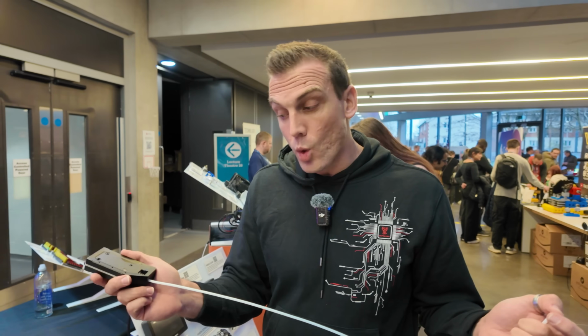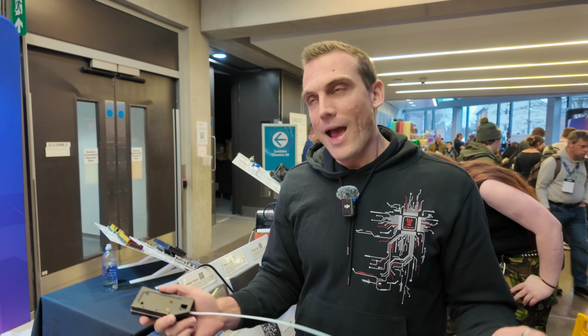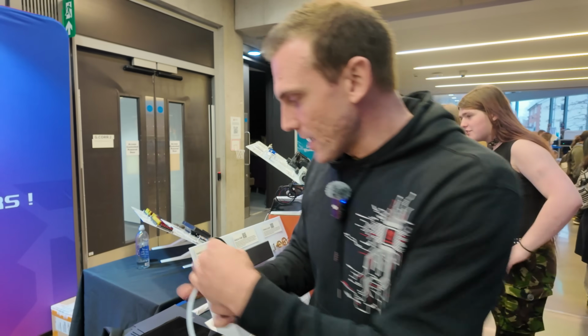Yeah, exactly. That's very nice. Ideally, we want it to work also with a cutter. The reason is you increase your reliability, and also each different filament needs different ramming settings, and it can become a bit of a mission to configure the ramming settings for each type of filament. The cutter just solves all of that. You can use it with ramming, but we recommend using it with a cutter. And the joy of open source is you can make it work. You can figure it out. Exactly, make it work.